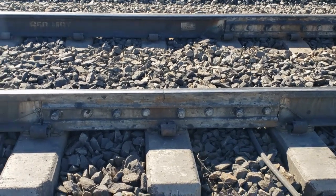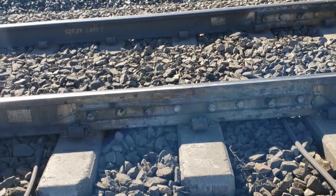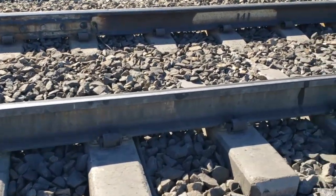There are other locations where insulated joints could be used and for different reasons. At an intermediate they could be used to separate the track circuits between two other intermediates on each side, or between an intermediate and a control point, or whatever. But that is what they are used for. Now we talked about I-bonds down at the derailment.